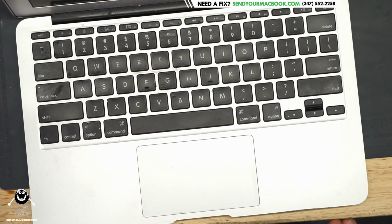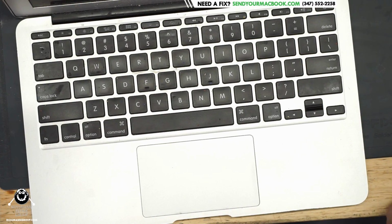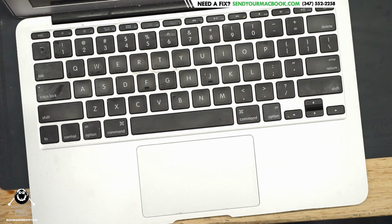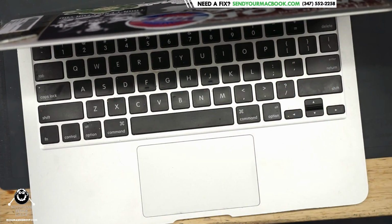It's just a beautiful little daisy chain of the keyboard has the ability to reset the SMC, which goes to the trackpad, which then goes to the computer's motherboard, so that even something over here, around your trackpad not working, can actually kill your entire MacBook. And it's one of the reasons that these often die. But today, we fixed it.